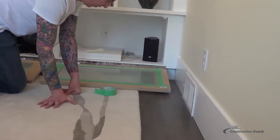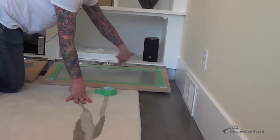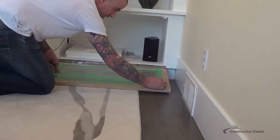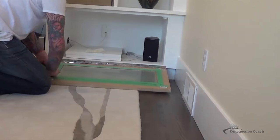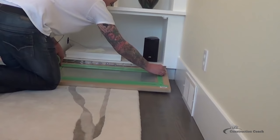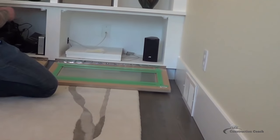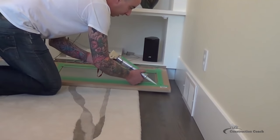Okay, I've got my tempered glass fit into the rabbeted edge on the door. There's enough space here for me to run a silicone bead to hold the glass into place. I'm just gonna run a silicone bead on the top and bottom, protecting with the masking tape so that I can get a nice bead in there, squeeze it good, and the extra will go onto the masking tape. And when I'm done putting the bead in, then I can just pull the tape and it takes all the mess with it. So I'm just gonna put a bead in this top and bottom tonight. And tomorrow I will proceed with fitting the last hardware on and painting.